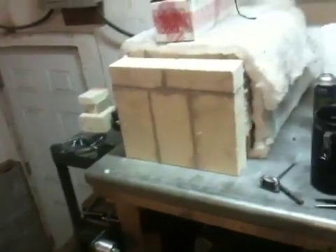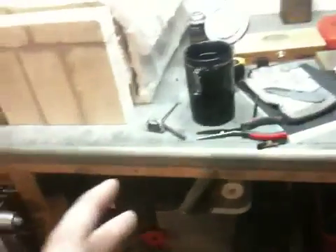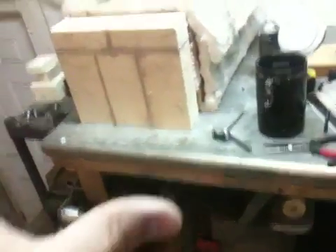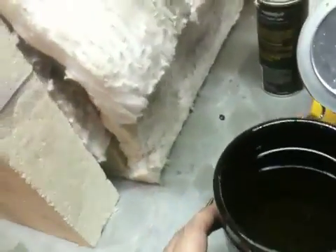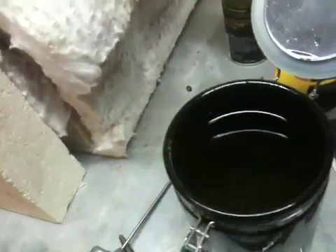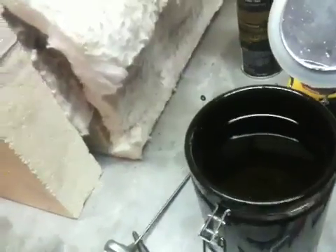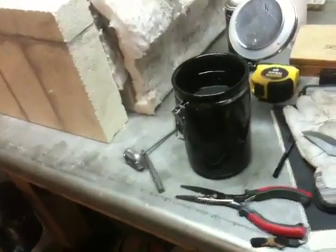Just before I open the oven door, I will quickly transfer my oil from the pot into a quenching jar, then just as quickly open the door, pull the blade out, and dip it in the quenching oil. After that's done, I will let the blade sit in the oil for a couple minutes just to make sure it drops down to a temperature I can safely handle. Then I will clean the excess oil off with some mild soap and warm water just to reduce any burn-off in the tempering process and keep my garage from smelling too bad.